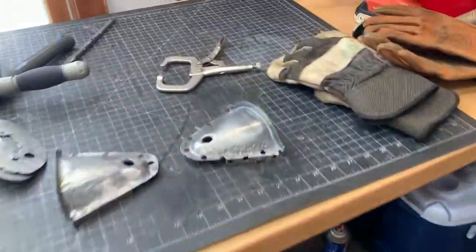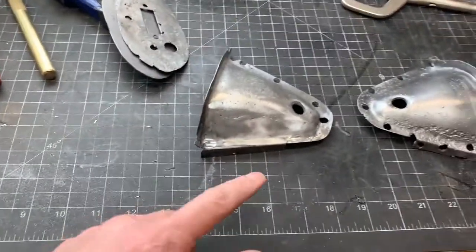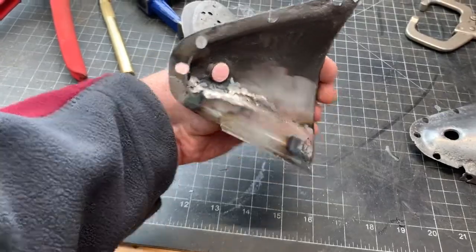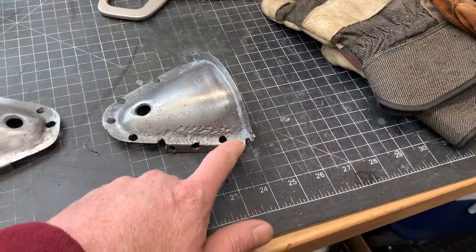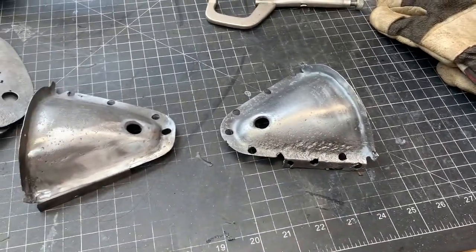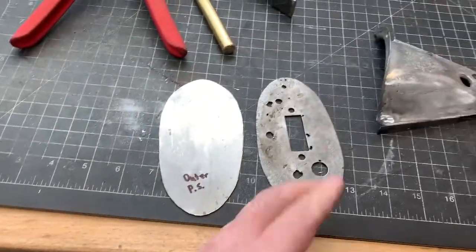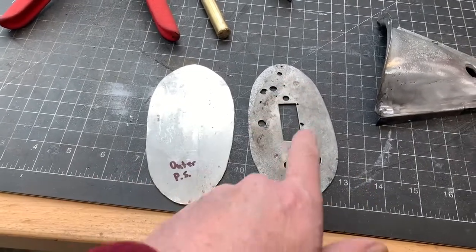The other thing I've been working on are these lighting nacelles. Here's one where I TIG welded — I did that last night. That came out okay. You can see the back side where there was a seam, but in the front it looks pretty decent. I'm going to do the same on this one — it's not quite as bad. I'll basically just cut across here and down, then fashion this angled piece. These are the two end pieces that mount on the side, and the light fixture mounts inside here.